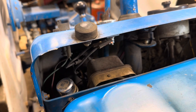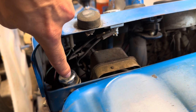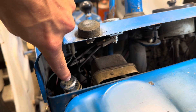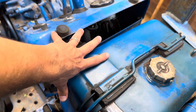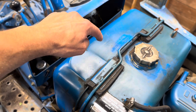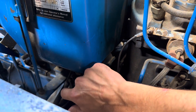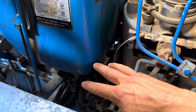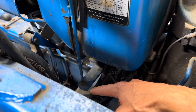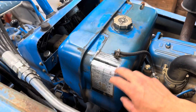Getting to this is a little bit fun, or at least interesting. You can see up top here — that's the glow plug indicator, this is the flasher (I actually put that in, that's an invention of mine with a NAPA flasher). The ignition switch itself is back in there; this is the voltage regulator. The fuel tank is right here — you can see the kind of space based on my hand that exists there. So really what I need to do is move the fuel tank. There's a fuel shutoff down here, so we can just turn the fuel off, and there's the fuel line coming out. I'm going to unbolt the bracket here — same on the other side — it's a 13mm nut with a lock washer, so you don't want to lose that. I'm going to get these fuel lines off and hop this out of here.